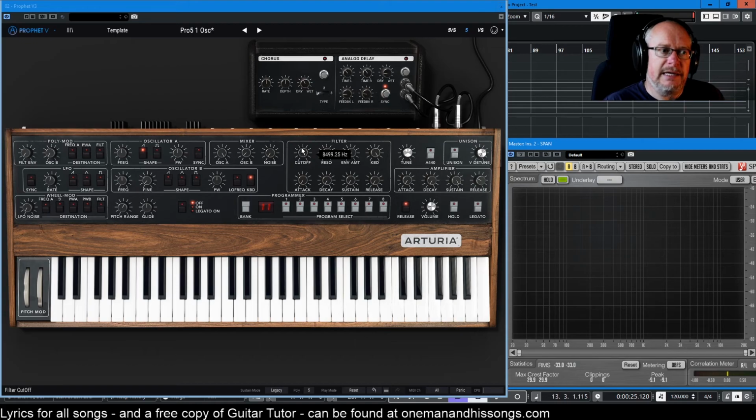And what it's going to do is, at a specified level called the cutoff, it will begin to throw away upper frequencies at the rate of 24 decibels per octave. So for every octave from the cutoff point, every time you double the frequency of that cutoff value, you attenuate the frequencies, you throw them away, at the rate of 24 decibels per octave. Let's just hear it.